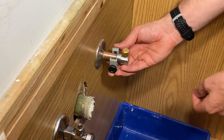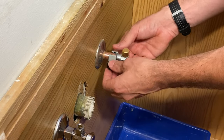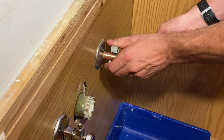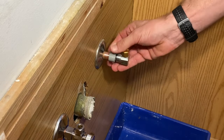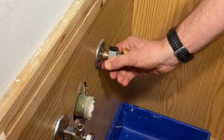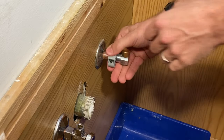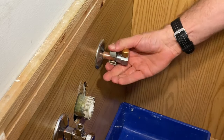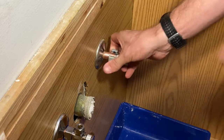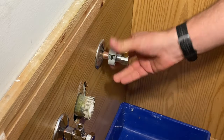Once you have it clean, take your tube cutter — and remember, down in the description you'll find links to all the supplies and tools used in this video. Take your time, slowly tighten down the cutting wheel, do a few circles to cut into the pipe, then do about a quarter turn each time and keep cutting. You'll start to feel when you're getting close to the end — especially with a 90-degree fitting like this, depending on where you are in your home, you probably still have quite a bit of water left in your lines.